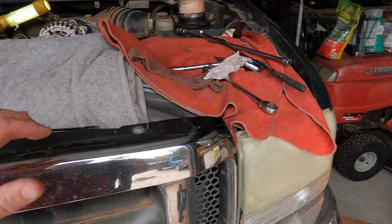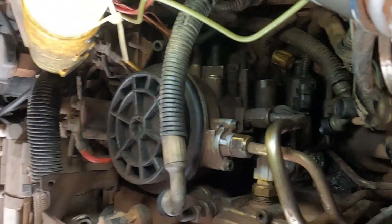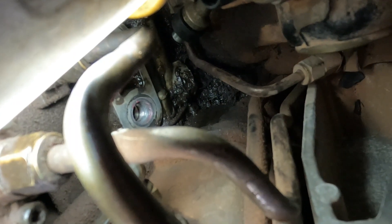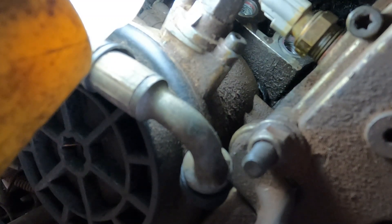So I look inside here - you can see the threads are missing or stripping out. This piece was loose, this one was not. This one was fine, but this is the one that was leaking really bad and it stripped out - the threads are gone. You've got to have the threads, because there's almost 4,000 pounds of pressure that can come out of this pump if demanded, and it'll blow that line right off.